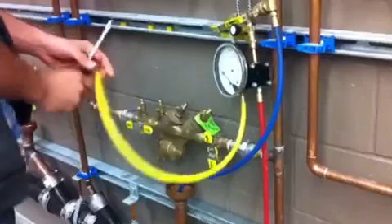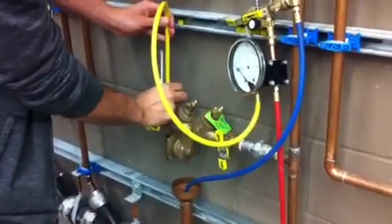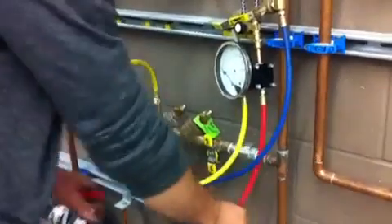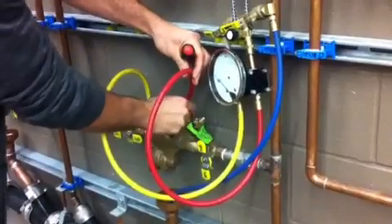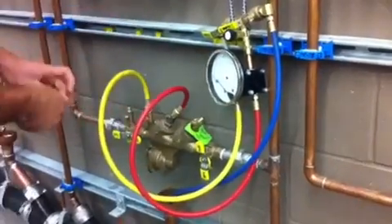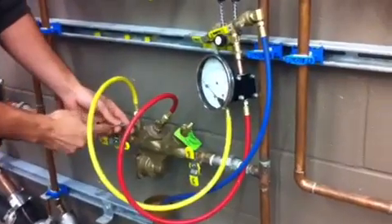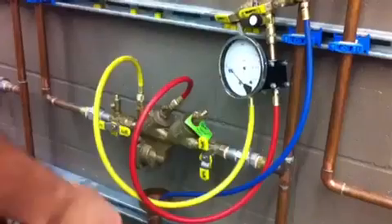The first test we're going to do is the relief valve — the relief vent. We're going to attach our high hose to test cock number one, two. We're going to attach our low hose to test cock number three. Open the low pressure zone first to lessen impact on the gauge, then open the high pressure zone.